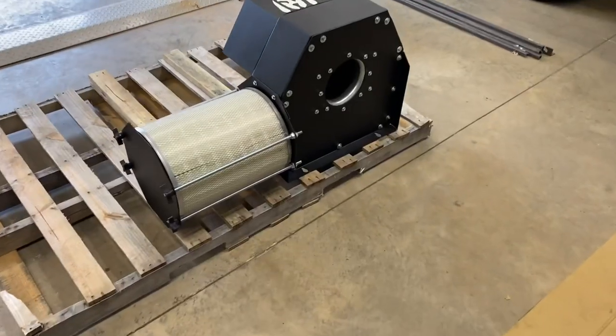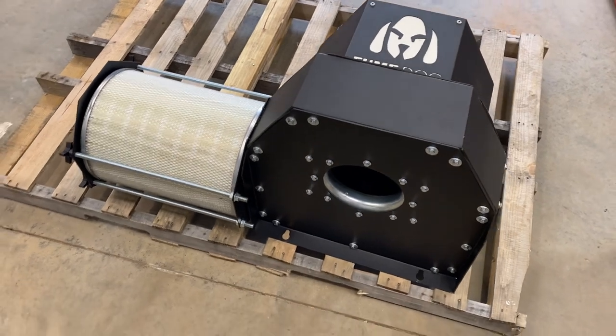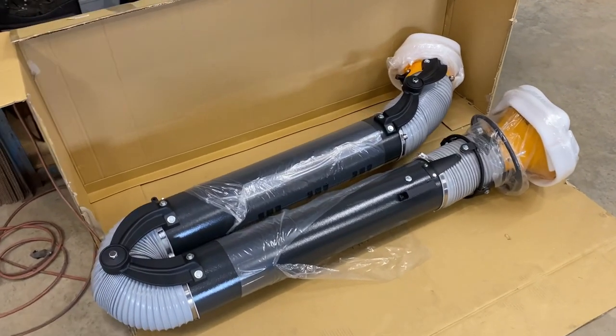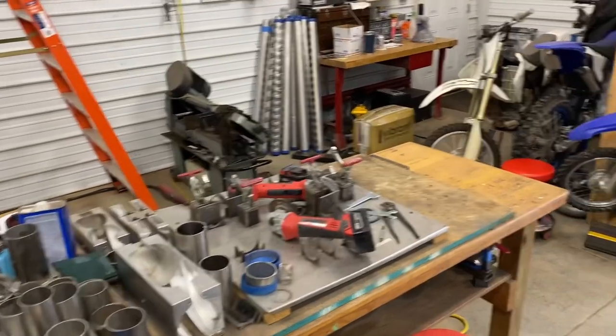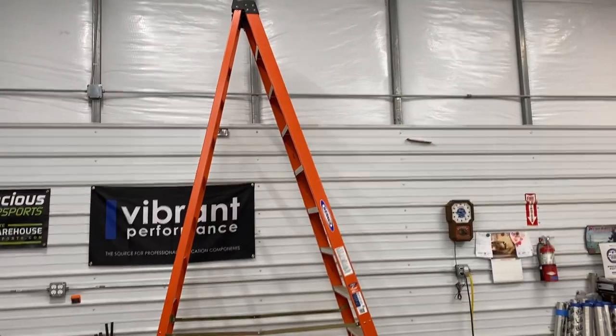Hey, Jake with Bond Performance. Just going to show you guys a quick installation video of my Fume Dog wall-mounted fume extractor. This is their wall-mounted unit — it's a 1200 CFM. I've got the optional 10-foot long 8-inch tube; it comes standard with a 7-foot, but I'm splitting the difference between my fixturing table, some weld fixtures, and a grinding area I use pretty often, so I'll be able to hit that from this central location.